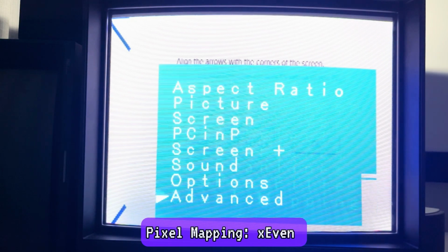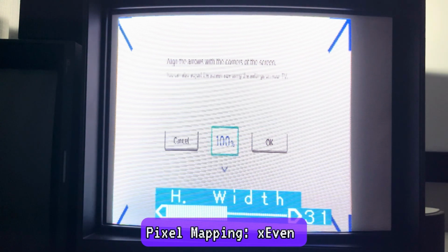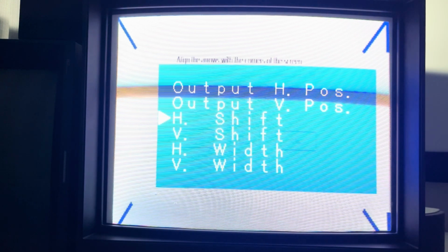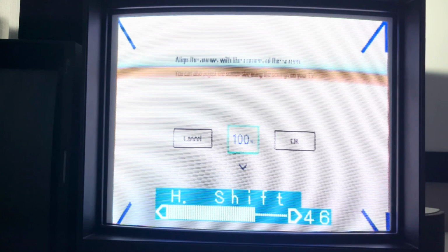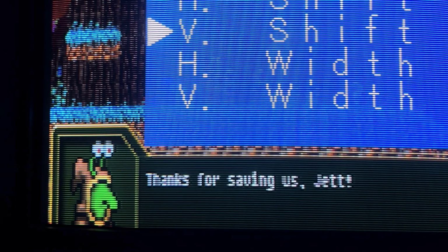There's picture adjustment options within the screen menu, but unfortunately doesn't help to shrink the image when the pixel mapping overscans, and instead just wraps the horizontal scale back around. So if you can overlook the scaling bumps with pixel mapping turned off, the screen options are otherwise fairly robust for HV size and centering within a predefined window. The vertical shift option moves the entire source video to help with perfect decimation of line doubled content, and also reading some larger text. Well, most text.